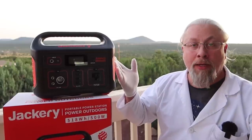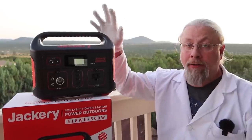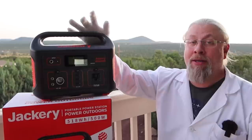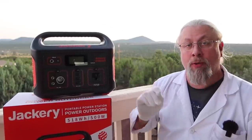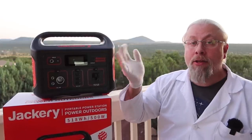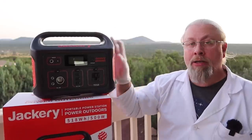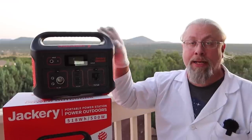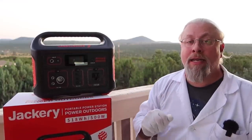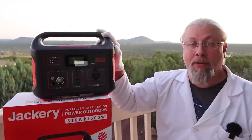For the recommended solar panel for the Jackery Explorer 500, I suggest getting a Jackery solar panel — they're made for each other, both portable, lightweight, and durable. Jackery solar panels are among the best on the market for portability, performance, weight, and longevity, and this week you can get $30 off. For the Explorer 500, one 100-watt panel is ideal — two panels won't really help in this case. For cheaper alternatives, check hobotech.tv/Amazon under Solar Kits. Note that Jackery products don't include an MC4 adapter for third-party panels, so you'll need an 8mm-to-MC4 adapter available at hobotech.tv/Amazon under Solar Adapters.